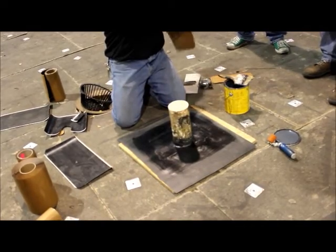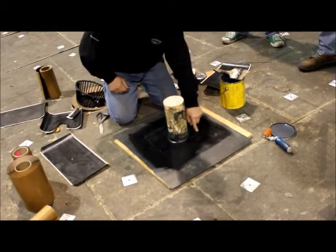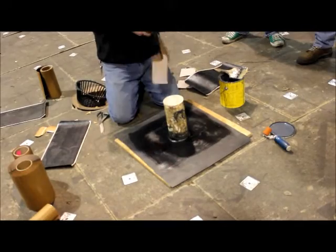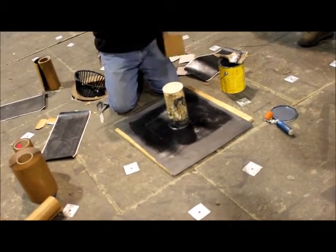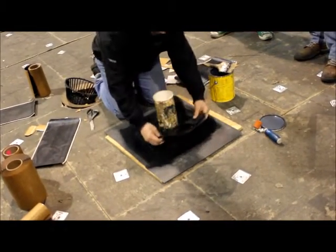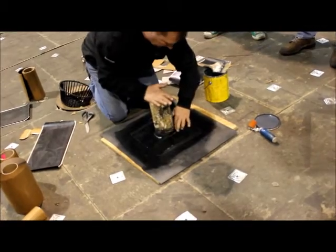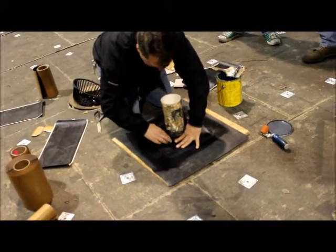Round your corner just on the one side. Touch it to make sure it's dry — it shouldn't come off on your finger; it'll tell you if it's dry or not. Then we'll throw our other base piece on — that's your two piece. You can do that the same way. You want it to turn up a little bit. You want to try to keep it somewhat even — just kind of stretch it a little bit so it becomes pretty even, then just kind of work it right around that pipe. Stretch it a little bit, get it going even, and then just work it around that pipe.